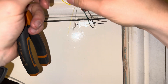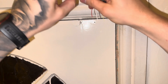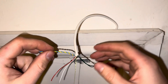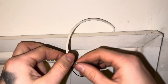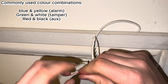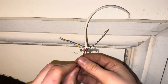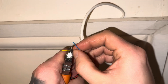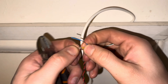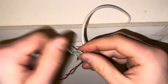I'm going to twist blue and yellow together — that's what I'll be using for the alarm circuit. You don't have to; you can use any color combination you want, but industry standard is often blue and yellow twisted together, with green and white for the tamper. Twist those together as well, and red and black for good measure. You can cut a pair of cables away if you want, but I always think it's good to have them as a spare. Clip the cables back to expose the inner sheath.